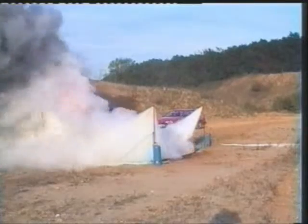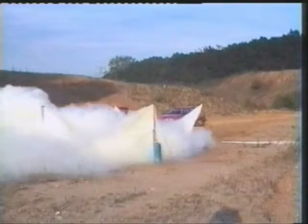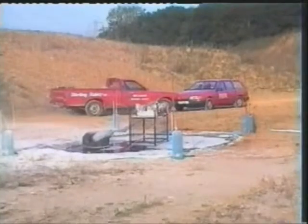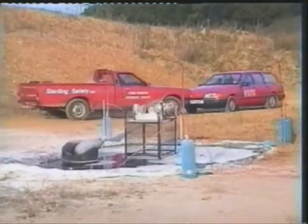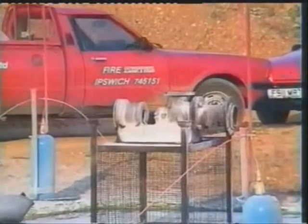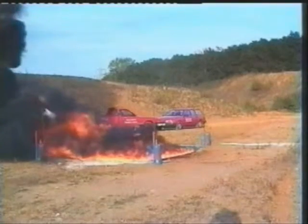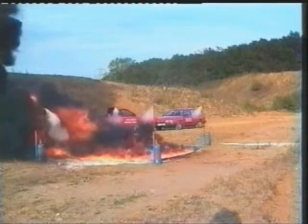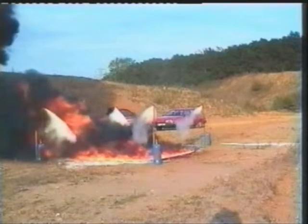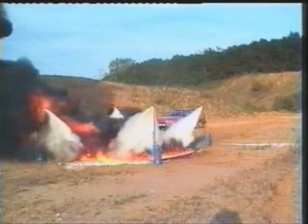A hydraulic control valve is also available to activate water fog systems. These valves require only the incoming mains water pressure to operate their on-off control. Individual extinguisher units can be harnessed together to form a modular system with a ring main of trace detection tube. In this demonstration, the Fire Trace detection line has been located well away from any direct heat to allow time for fire to become established before the system operates. These four 9kg dry powder extinguisher units would be sufficient to protect a room of approximately 100 cubic metres. This feature could prove useful when protecting moving machinery or conveyor belts.